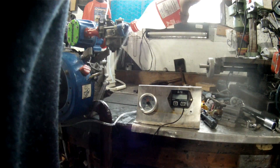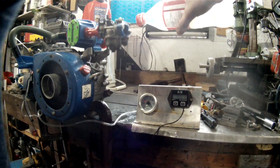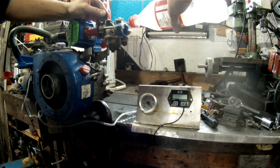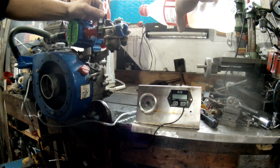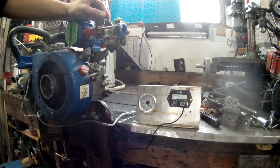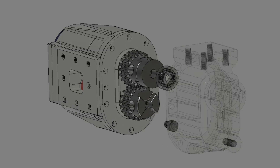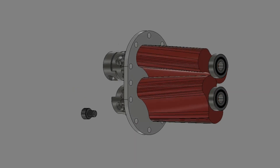The other advantage is there is no machining involved — I made it all pressed together with straight shafts, preferably tubing. The only thing you could consider machining is cross-drilling the bolt holes for the gears and drive lugs. I also have a few designs that are slightly larger — both an 80mm and 120mm length housing of the same diameter. I've been holding off on printing them until I could test this one, and so far everything seems good, so I might get underway on the bigger one.